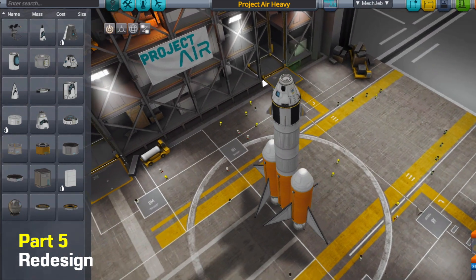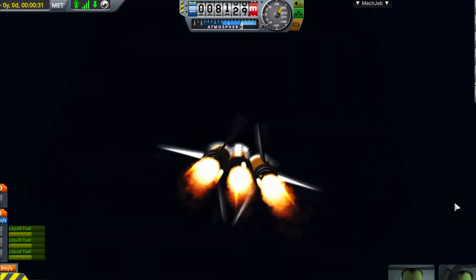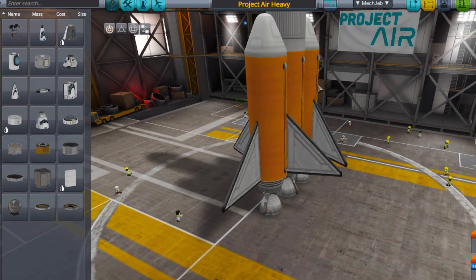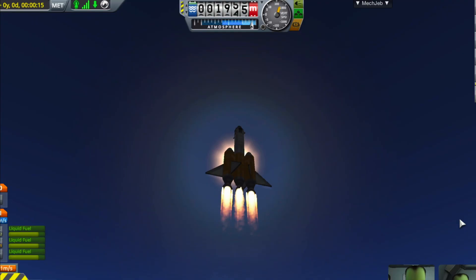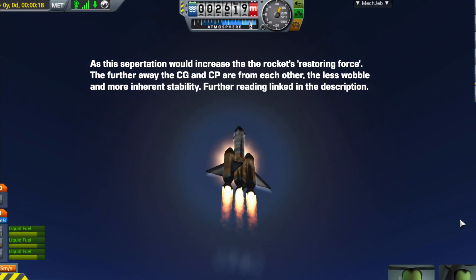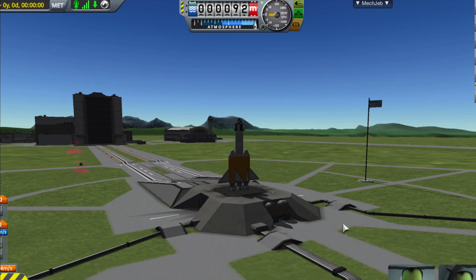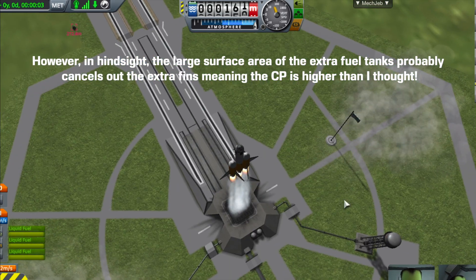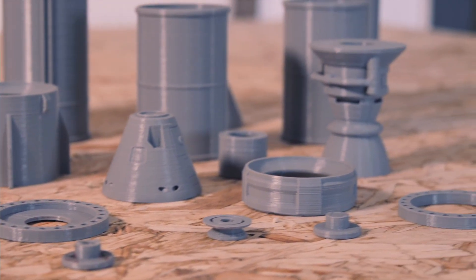The new design specification was in place. Firstly, I had to make the new rocket more powerful to increase its velocity and, hopefully, its altitude, to give the parachute time to deploy. For this, I decided to add two more engines that would go either side of the original engine, underneath similar fuel tanks. Secondly, I needed to raise the CG to increase the distance between the centre of gravity and centre of pressure. I did this by adding a couple of smaller fuel tanks between the nose and the main rocket. Finally, I wanted to add more fins to make the rocket more stable. It seemed to work well in the game, so I went ahead and printed off the new parts to assemble the V2 in real life.